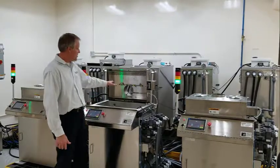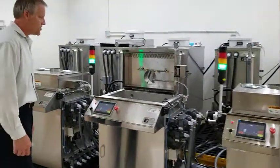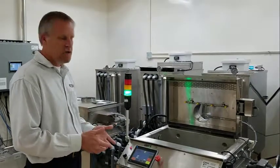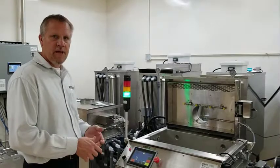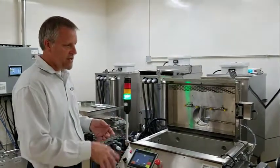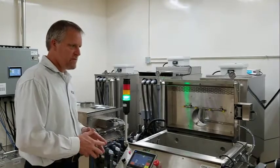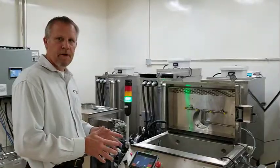The cover also has sprayer nozzles in it. Those are used for spraying the tank down to eliminate as much cross-contamination as possible after all of the chemical steps. So after the alkaline drain and after the acid step, we're spraying with fresh water and it's going down to a waste containment area. That's an overview of the system — it's an automated process for passivation where we're moving liquids rather than parts.